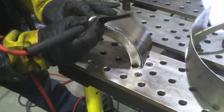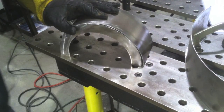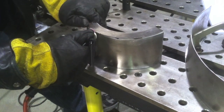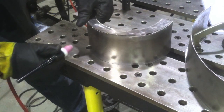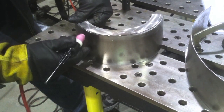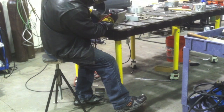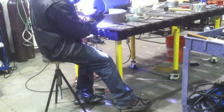You'll get really small, really clean tacks that work out quickly and helps you get things done fast on a job like this. I find one place where things are touching, rock the tip in to where it touches, get just a little arc gap, and then hit the pedal as quickly as possible. I'm setting 125 amps here for 16 gauge. You better practice on scrap or you're going to have holes — you've got to be quick. I'm using the HTP 221 — it's got a spot timer, set for 0.2 seconds. At 125 amps, any longer and you're going to have melted-away edges.